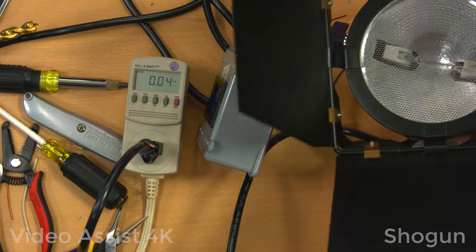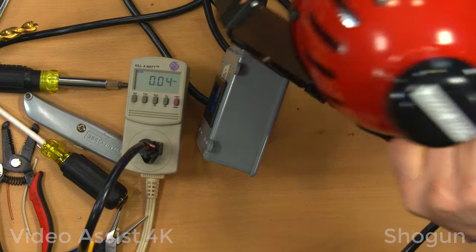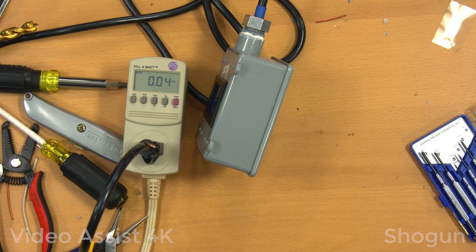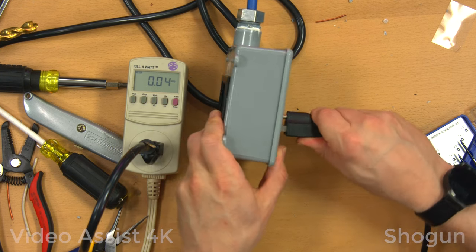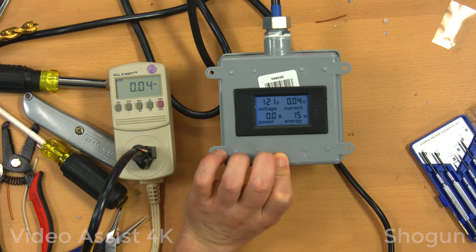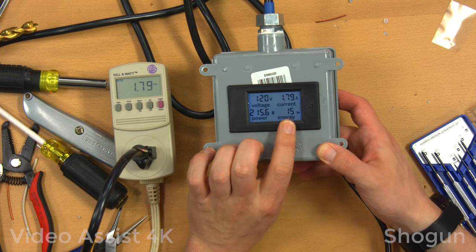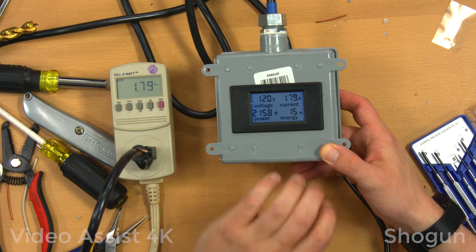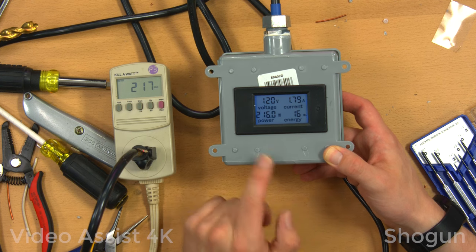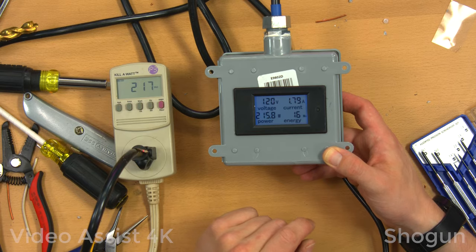All right, I'm gonna try this. This is a halogen light bulb. It's a straight resistive load. It's 250 watts, so it should measure just about that. I'm gonna keep the light out of the shot so it doesn't completely ruin everything with its brightness. And it's off right now, and I'm gonna flip it on. And we're measuring 1.79 amps. 1.7978 on the kilowatt meter. That's just about perfect. And wattage, well, it's not a full 250 watt bulb, but these are pretty much in agreement. I mean, close enough as far as the margin of error goes.